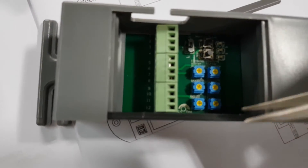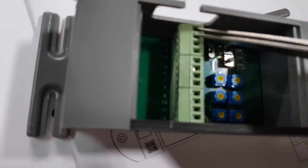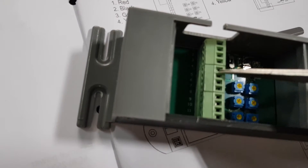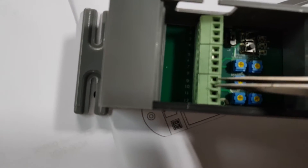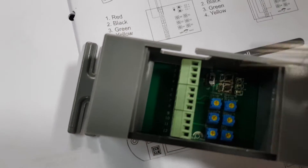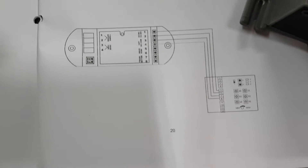In the older model there are three connectors on the left, middle, and right side of the microcontroller, with all connection details given in the manual on pages 18 and 19. In the new model there is a single connector with twelve pins: pins 1-2 are power supply and 3-4 are NO/NC for the inside sensor; pins 5-6 are power supply and 7-8 are for the photo beam sensor; pins 9-10 are power supply and 11-12 are NO/NC for the outside sensor. Details are on page 20 of the new manual.